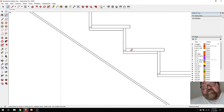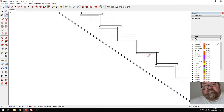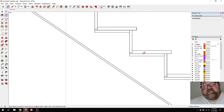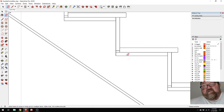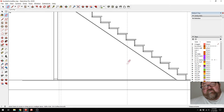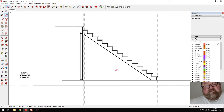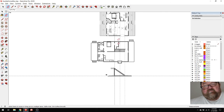And of course, if you use trim screws, a good heavy trim screw will keep it from squeaking too. The nails are what squeak. The nails rubbing against the wood is what squeaks. It's not actually the wood squeaking. It's the nails you missed into loose wood.